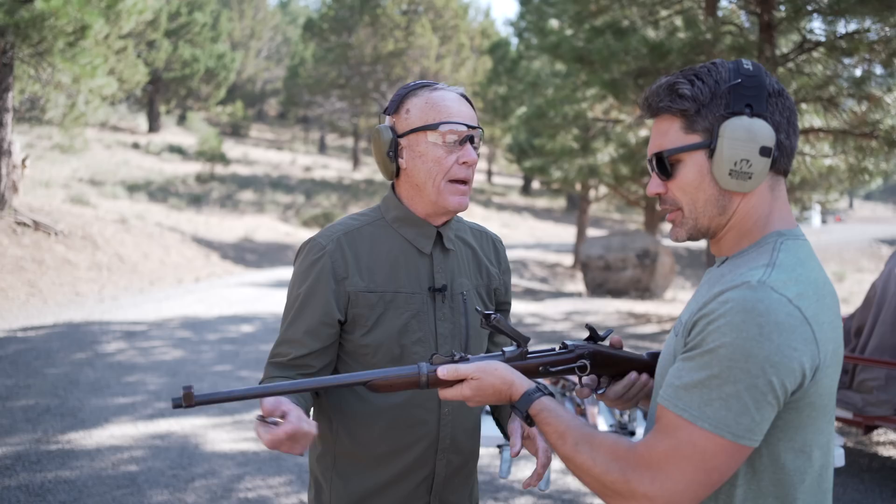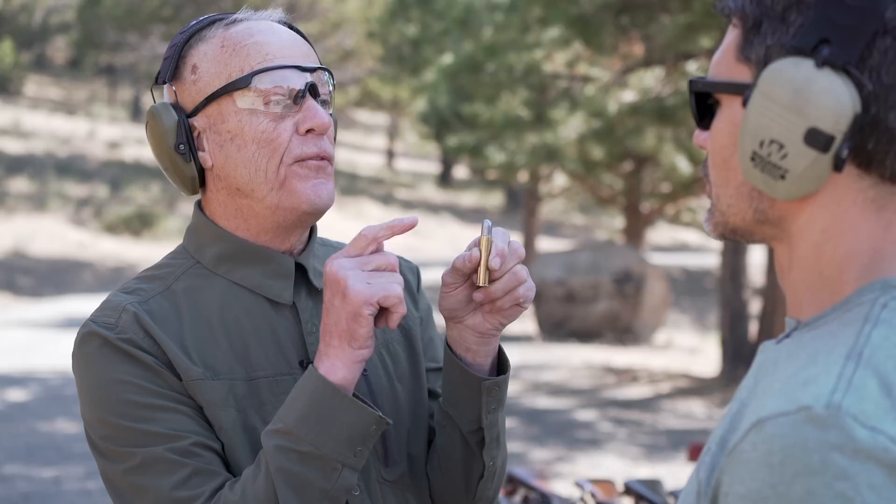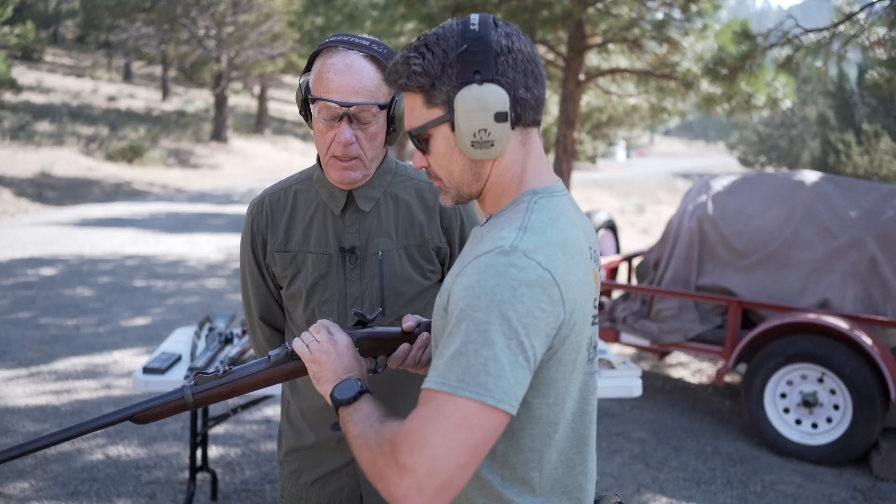If I look down the barrel, it's crystal clean and sharp — shiny as a new baby's butt. We fire the first round and it's going to do what we call fouling down. Generally, if I would go bison hunting, when I went out in the morning I'd put a round in a clean rifle — my Sharps, which you'll shoot — pull the trigger and foul it down, because the gun zeroed on the foul, not a clean bore. They can shoot differently. This is truly a .45-70 government load — 70 grains of powder. The box would say .45, then 70, then a dash, then .520 — that's the caliber, the powder load of 70, and the bullet at .520. Push down on it, and you're ready to go.